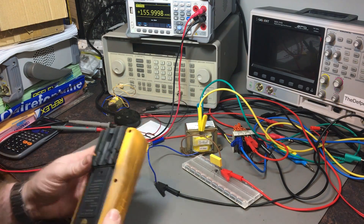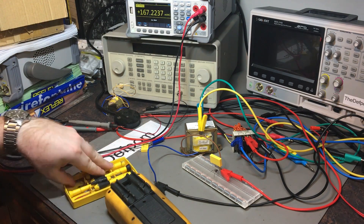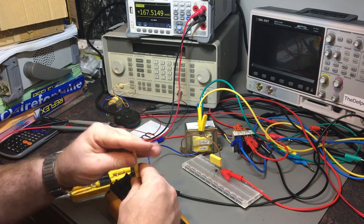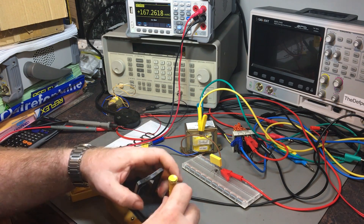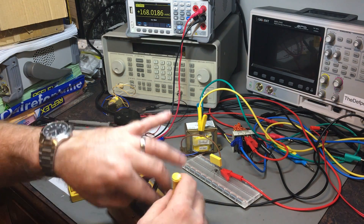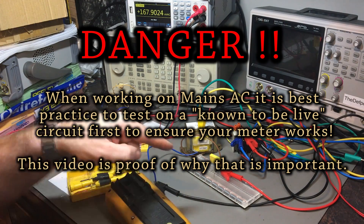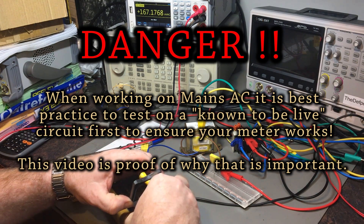So I might actually just pull that apart and sort out the battery first. I'll demonstrate that, you know, you can't always trust your meter. Sometimes it isn't actually right. Just change the battery first — we'll do that before anything else, just in case that's all that's wrong with it. But that's why you have to check with two meters if you're doing AC work. There's a risk of killing yourself, so use two meters. And this is why — because I knew there must be voltage there, and this meter was saying it was safe to touch. And no, it really wasn't.